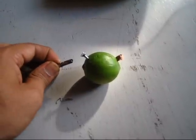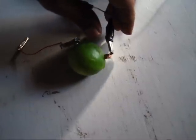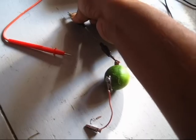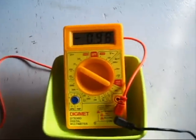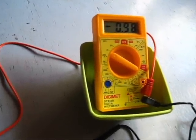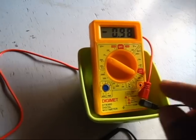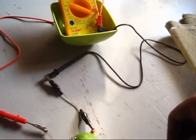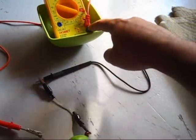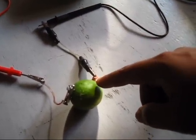First I will connect the jumper cables so that the voltage won't fluctuate. The voltage is 0.99 volts, but the negative sign here represents that we have connected the opposite terminals — I have connected the negative one with copper and the positive one with zinc, which should be the other way round.